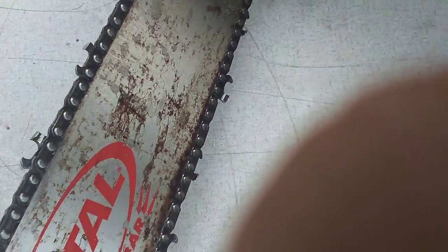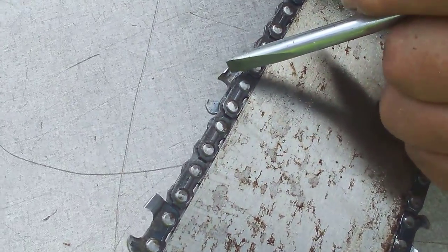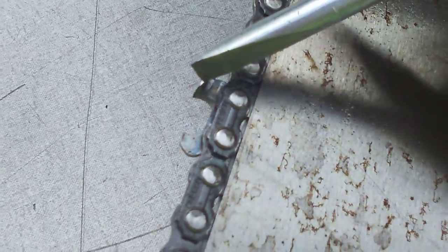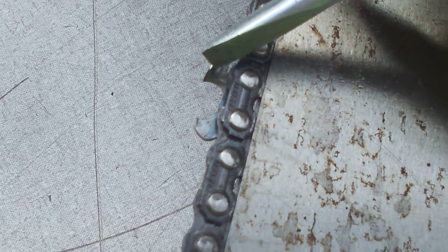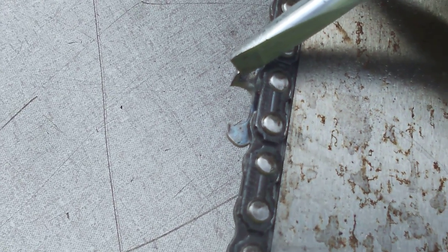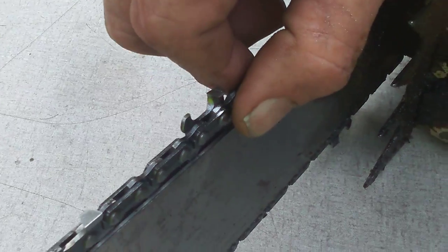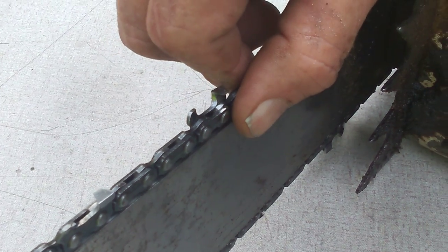For summertime, I'm leading my angle just a bit. Look down at that top angle right here — it's leading just a little on this working edge; this is your working point. When you look up underneath there you can see the width of that is fairly much the same right across that point of the tooth. When you have it like that, during the cut that chain is not pressing into the bar — it's actually relieving pressure and pulling up just a little bit.